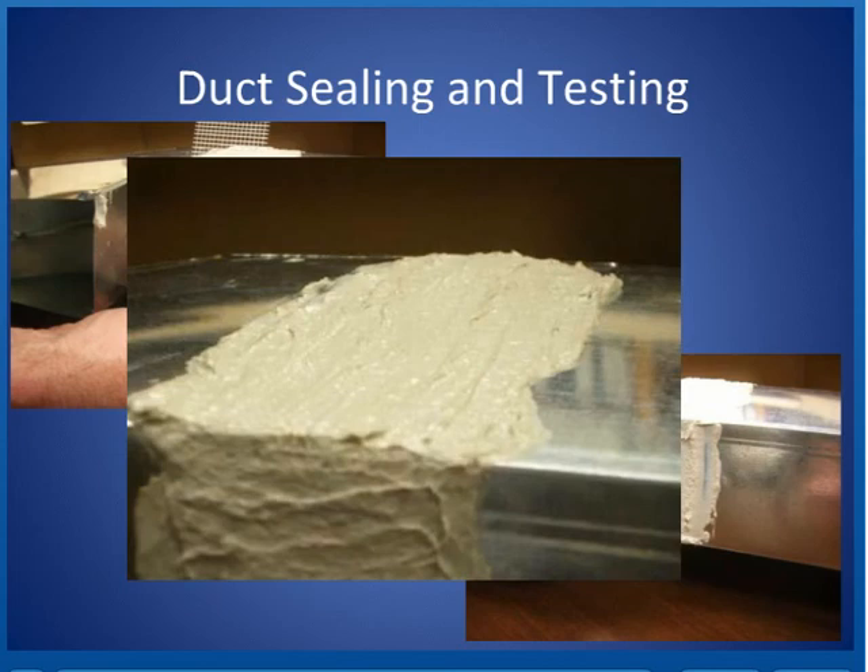It's pretty thick on this. This particular type of mastic is flexible — it remains flexible. So as the duct flexes and moves, it'll stay flexible. I know it lasts over 25 years because something that I put on is still there, and it's still flexing, and it's still working, and it didn't crack.